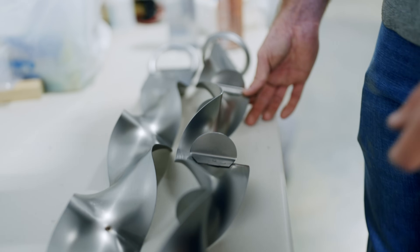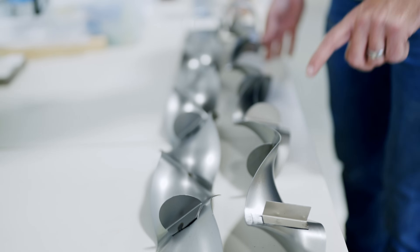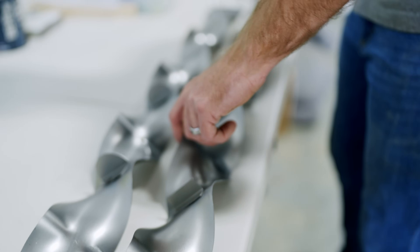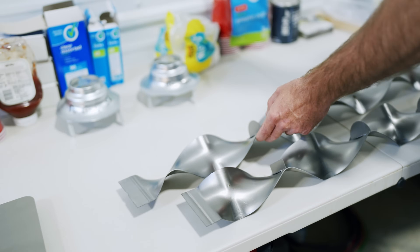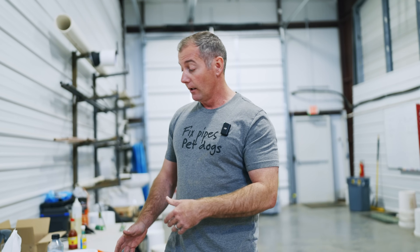The box store baffle has six rounded tabs and two squared tabs; the pro-grade has four rounded tabs and no squared ones. Yet again another feather in the hat — these are not the same heaters. The longer the baffle, the better it heats the water, meaning better water heating performance out of the pro-grade unit. The baffle length difference alone is a fairly notable finding.